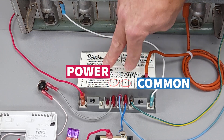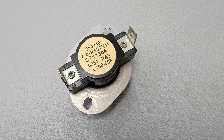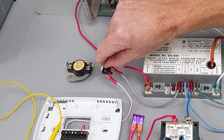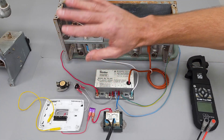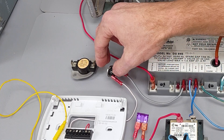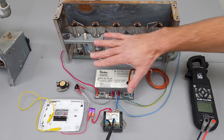That's going to power this direct spark ignition module. Say your heat exchanger was warming up and the blower motor was not turning on — this high temperature limit switch in series would open up the electrical circuit. This flame rollout switch is going to pop if you had the flame roll back, which would be due to a safety concern such as a crack in the heat exchanger. That's a serious concern, so make sure not to just keep pressing this button to reset it — verify there are no safety hazards present.